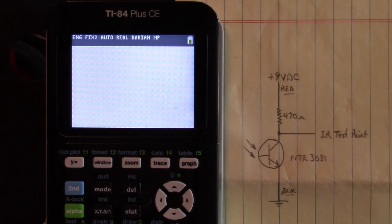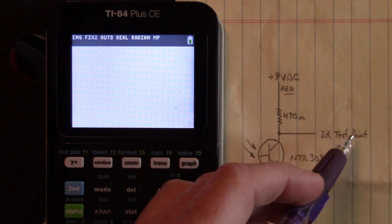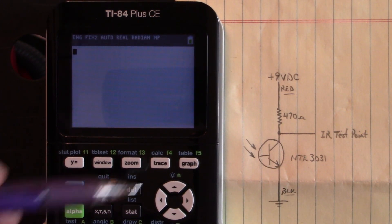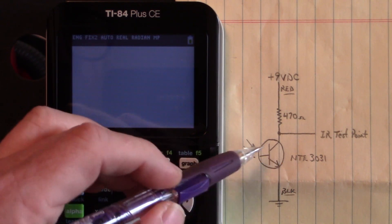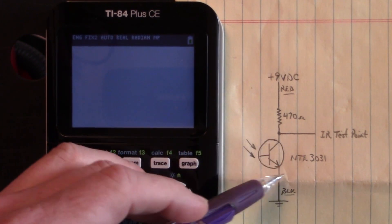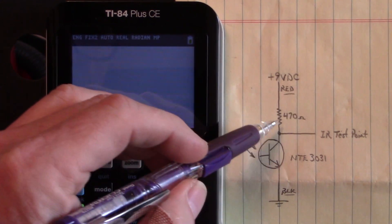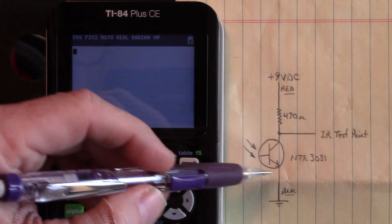To get a little bit sidetracked from what we're talking about right here: the Fluke oscilloscope was looking at this point right here, referenced to that 9-volt DC battery ground. Now according to Kirchhoff's voltage law, if this phototransistor is conducting in full saturation and I have 0 volts from collector to emitter, I must have that 9 volts DC across this 470-ohm resistor, and we can determine the current through this circuit right here.